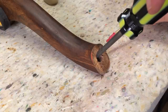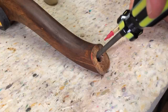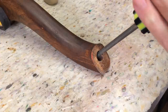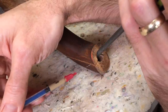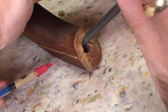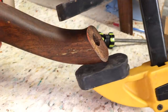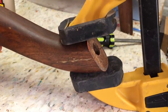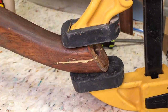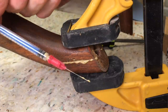So this way I'm getting a lot of glue coverage in that crack — going all the way down one side and in the other. When it dries it's going to be really strong. I can actually see some of the old paint that used to be on this chair in a bit of that crack, so this is not new by any means. I'll put a clamp on it and you'll see lots of squeeze out — just shows you how much glue you can get into a crack like that if you're using a syringe. It's really handy.